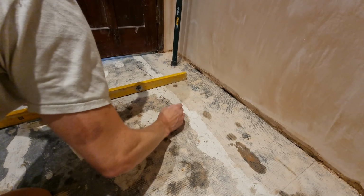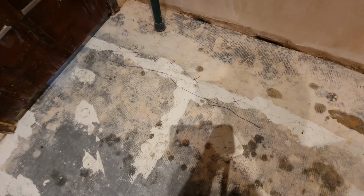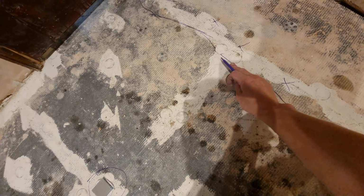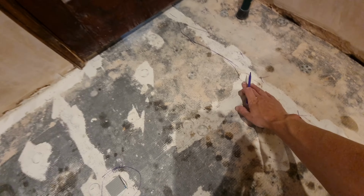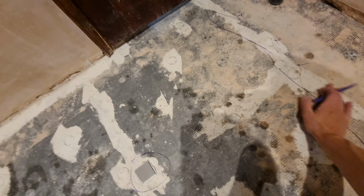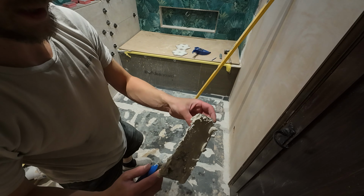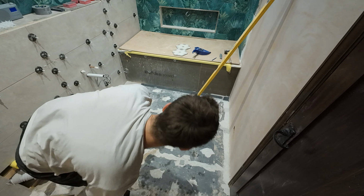And then you'll start to build up a line where you don't want any self-leveling, so then we know that when we do self-level, this will be to nothing and it will be flowing this way. So yeah, it's important that we don't make our high point any higher, so we'll make sure this is literally right on the deck here. And this is just normal flexible tile adhesive, but like I say, it's 6mm. I can put a piece on the backerboard.